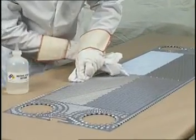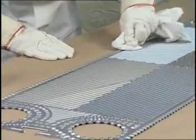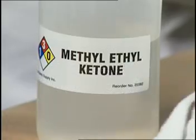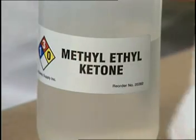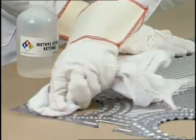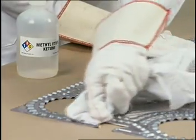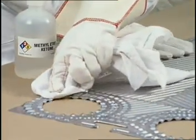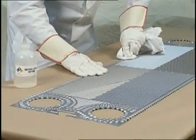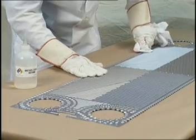After the gasket is removed, the gasket groove should be thoroughly cleaned. Adhesive residue, oil, grease and other foreign matter can be removed by applying methyl ethyl ketone or acetone with a rag or nylon brush. Other solvents, such as commercial paint-stripping compounds or Permatex gasket-removing compounds, are also effective. Just be sure that all of the solvents or compounds are completely removed from the plates and ensure that the groove is clean and dry.